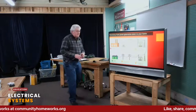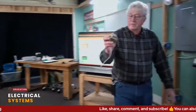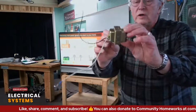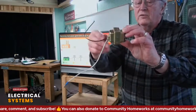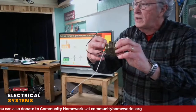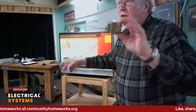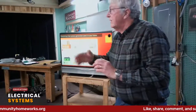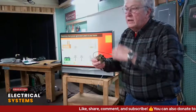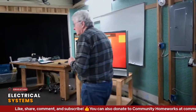Here's a small example of a transformer. Inside a transformer are basically two coils — a small coil of wire and a large coil. As electricity moves through one and then moves backward, because at our power plants we have what's called alternating current, the electricity moves back and forth. As it moves through one coil, it creates a higher voltage in the second coil.